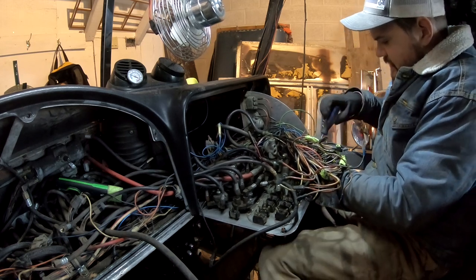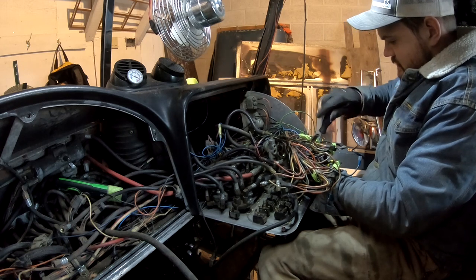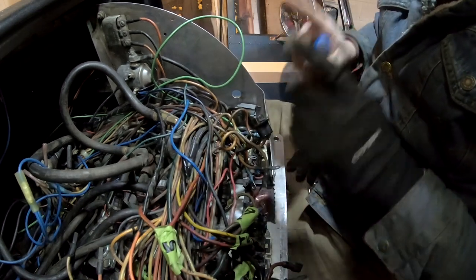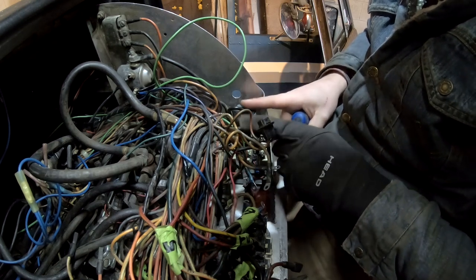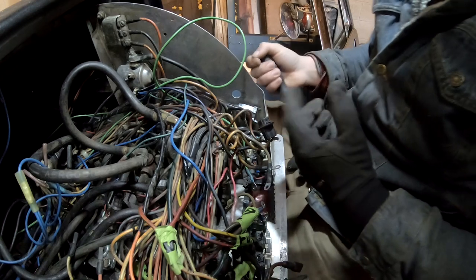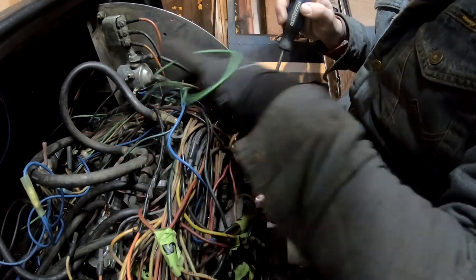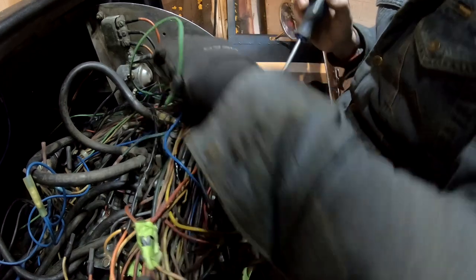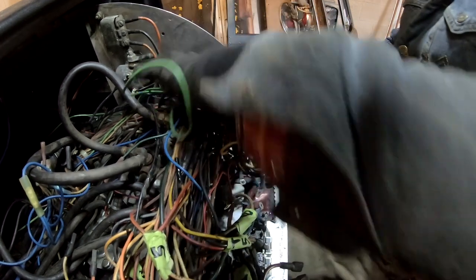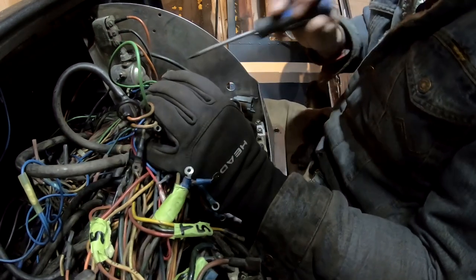Basically these breakers are all daisy chained together with a power wire, and then whatever breaker you want to use for whatever circuit, you just attach that to it. The way these breakers are configured is they have the power running down the outsides and then the two inside screws are set up to be used as your power to your switch. That gives you a nice center line to work on with the screwdriver so you're never in too tight of a spot, except where the daisy chaining doubles up to cross over to this little fella here.